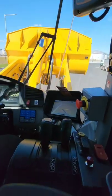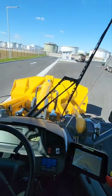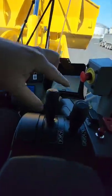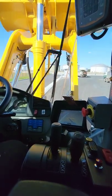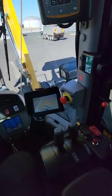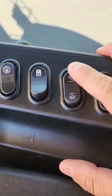When we come down with it, it's gonna stop automatically above the ground. Pulling that all the way back, you can see I'm not holding that - it's gonna stop at the very highest point and come to a nice easy stop. Now we can change that position with the boom height selector switch.